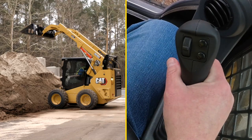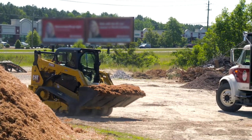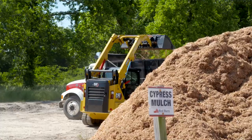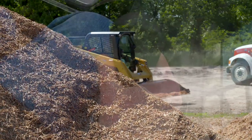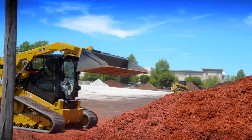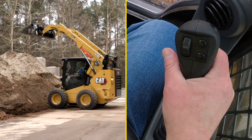Then we clear the sideboard. Normally, without the return to dig feature, you'd manually have to adjust the joystick to lower as you back away from the truck and also rack the bucket to a more tilted-back position. With the return to dig feature, all you need to do is move the joystick as you normally would and incorporate the trigger press into that movement — not before you leave the center position and not when you reach the end of the stroke, but as part of the movement on the way over. In this case, when we're lowering and racking, that's a combination of two functions that takes the joystick to the 11 o'clock position. As we back away, I'll move the joystick and then move my hand away so you can see the action of the joystick and what happens to the work tool.